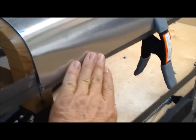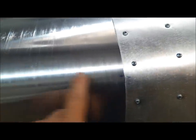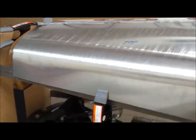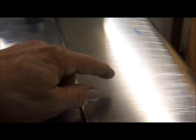I can easily bring that down as I come along with the screws — it'll start to lay down and I'll work my way around from the top down. This panel is still a hair long. After I mark it with the marker I put it on the bandsaw and trim it within that marker line, which gets me close enough to hand file to what I want. You can see the marks from the roller here — I struggled on this first one, it took me a couple of tries. I started from this side and worked the tight radius first.